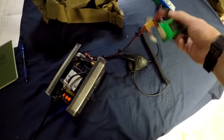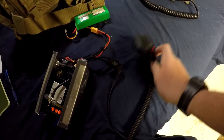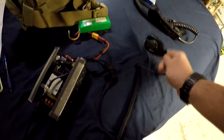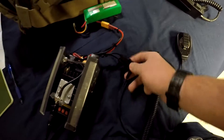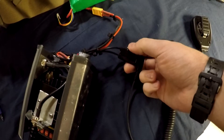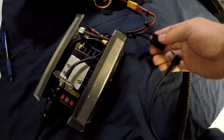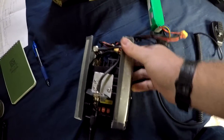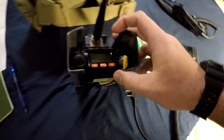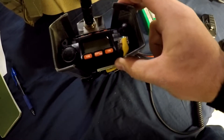Here's the main radio itself. The battery connects via XT60 using another LiPo. I'm currently just using a little Baofeng speaker mic while I'm waiting on my adapter to be able to use the H250 handset. I have a two-and-a-half and a three-and-a-half millimeter headphone jack on the female side coupled together with a spacer made of cardboard and electrical tape to make it work on the Kenwood plug. There's a broken-out three-and-a-half mil male side that plugs into the speaker jack on the back so I'm pulling audio out of the radio, and I've made a custom RJ45 cable that plugs into the front and is where I'm pulling the microphone, power, and everything else.